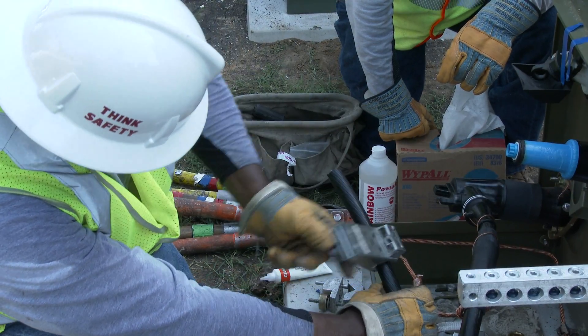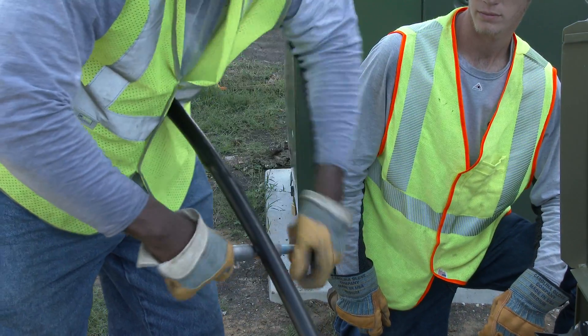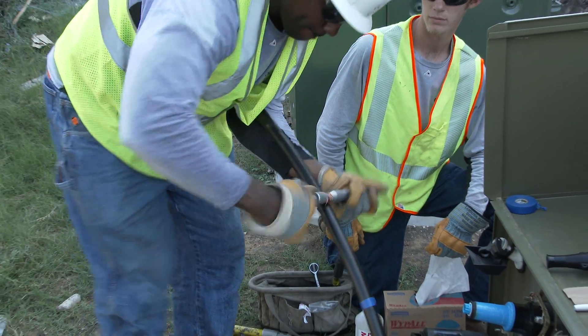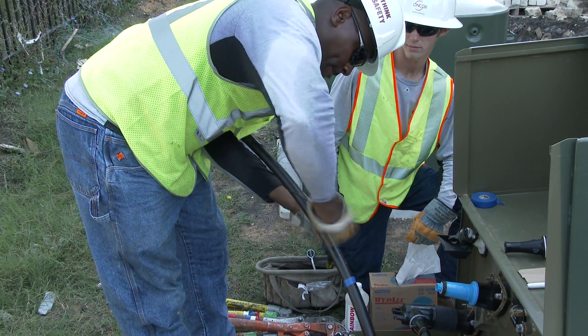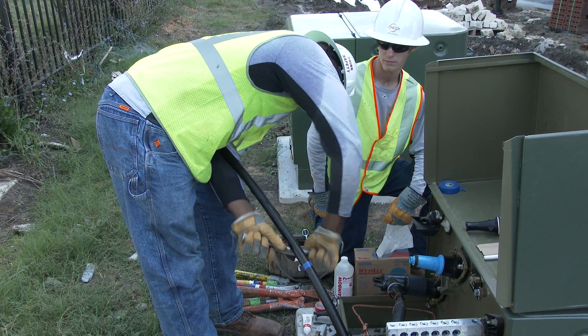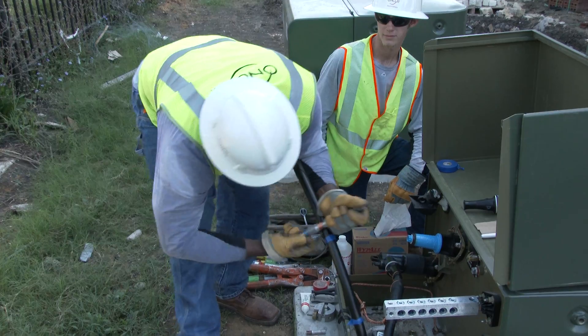He then scores the jacket at the mark and uses one of the concentric neutral wires for removing the jacket, being careful not to break the concentric wire while pulling through the jacket. He uses a neutral winder designed to roll along the axis of the cable to prevent damaging the concentric using a ratcheting motion.